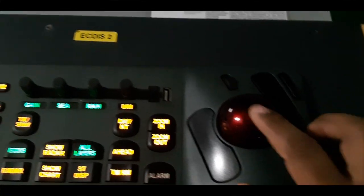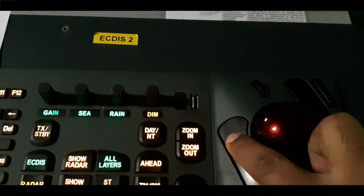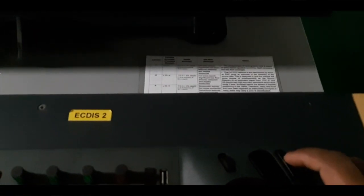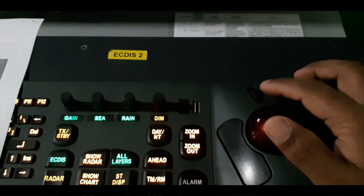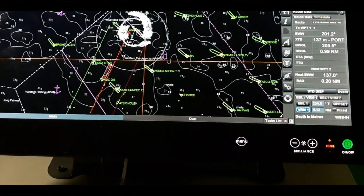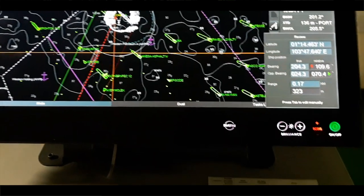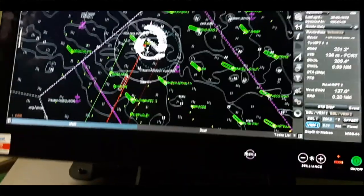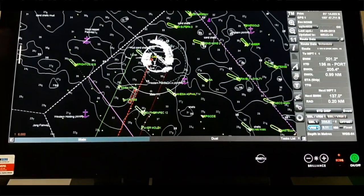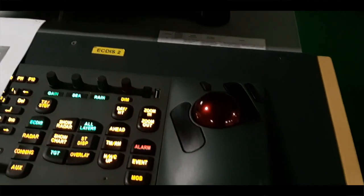You can also see our mouse here. The left button is for the right-handed person, and there is also a left button for the left-handed person. This is our right button. With the scroll wheel you can zoom in and zoom out, and there are other features too. If I push the left button you see this comes up, and the right button goes to another option. This small right button here is for cancel — whenever you do route planning or passage planning, it is very useful. You need to know the shortcuts and tricks to use this mouse effectively.